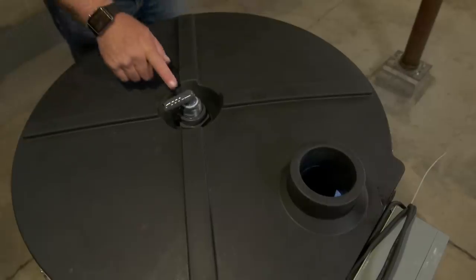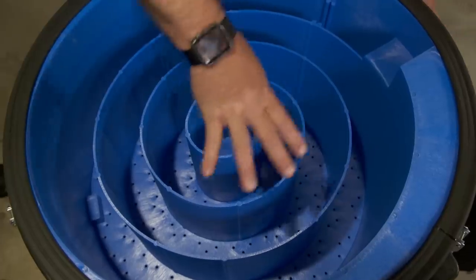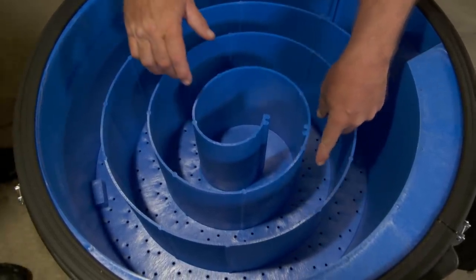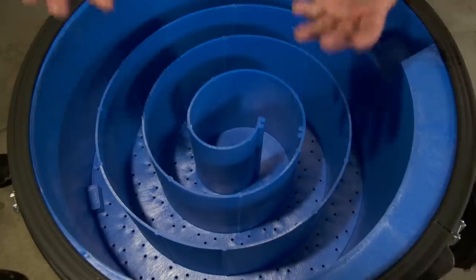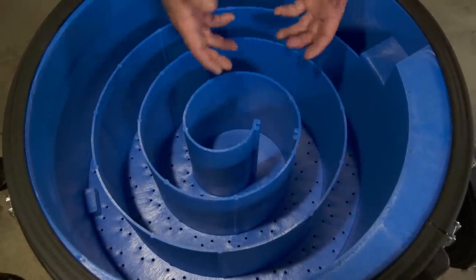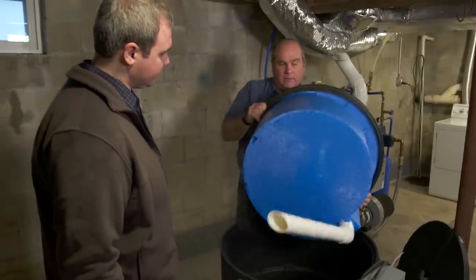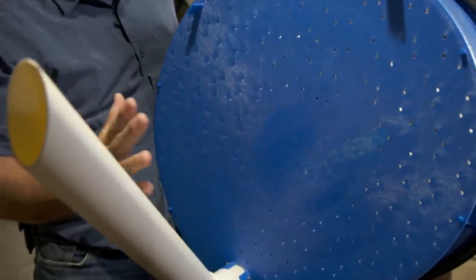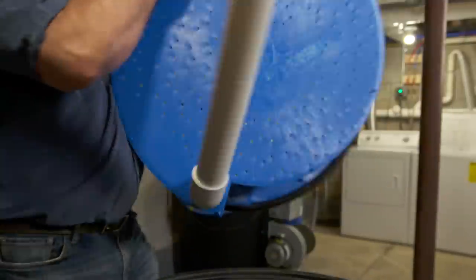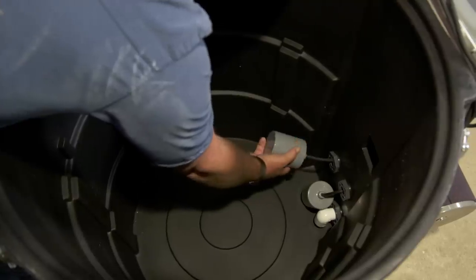Here's a water line and an exhaust. Underneath the inlet there's a spray nozzle — water comes out here and sprays into the top tray, going around. Look carefully at the holes at the bottom — it's much like the air holes on a table hockey game. There's a blower underneath that pushes air up through the water as it circulates. That air coming through pulls the radon gas out of the water. On the bottom side, you can see the holes — powerful forced air comes up through the water and works its way down through a pipe.